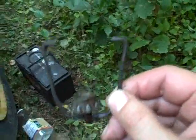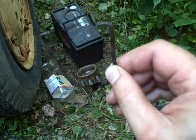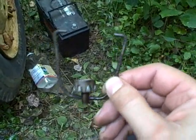Oh, I hate when that happens. It's really tight quarters under there, and I was trying to feel around to get the bowl in place, and the keeper fell off, so hopefully I can hang that back in there without being able to see. It's a good thing I got long fingers, good manual dexterity, and long arms, because otherwise I never would have got that back on. I got it on from the other side because there's no clearance on this side with all these hoses in the way. There's some hydraulic lines right here that are in the way. I couldn't even feel a gasket in there, and I know it didn't drop off because it would have fallen right on top of the transmission bell housing here, and it's not there. So I'm hoping there was some kind of a seal in there that I just couldn't feel. Otherwise that's going to leak like a sieve.